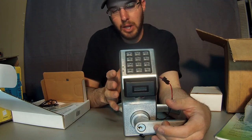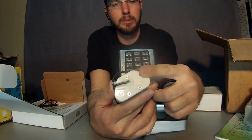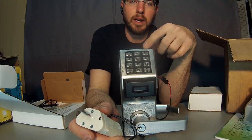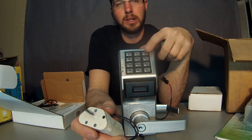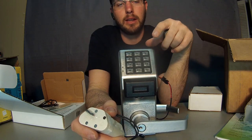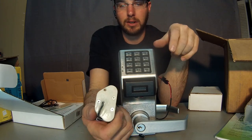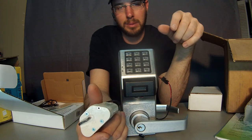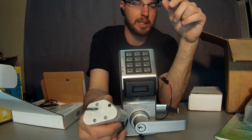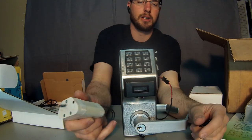This is also a standalone unit, which means it does require batteries. This is your battery pack — there are five AA batteries in here, regular standard batteries. The advantage to that is you don't have to hardwire this lock in, so the installation is much less expensive than a hard-wired unit, and you don't have to worry about power going out and your security being compromised. This battery pack, even in commercial applications, will last at least one year, probably more like two or three before you ever have to replace the batteries — and that's a pretty simple process. The cap comes off, new batteries go in, and you're good to go.